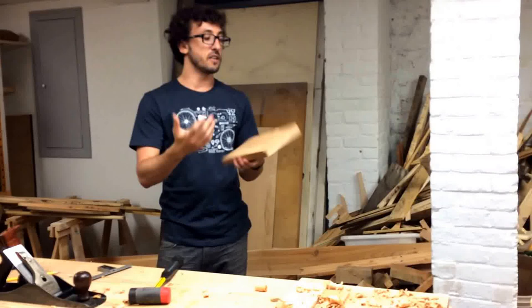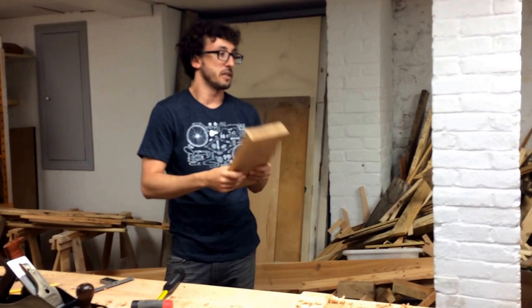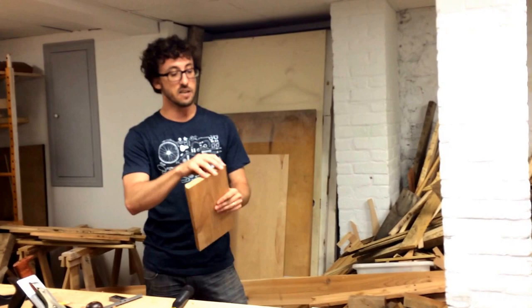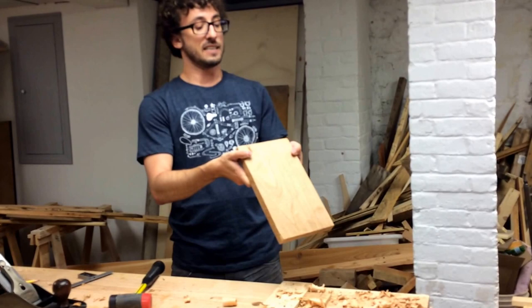And now let's say we need a certain thickness of board. When you're doing hand tools, you tend not to say, "Oh, I need a piece of wood that's 7/8 inch thick, or five sixteenths." It's just, as long as all the pieces that I'm going to use for a particular function are generally the same size. Sometimes they don't even need to be that close, because you're doing everything by hand. You're not setting up machines to make cuts. Everything's individual to that particular situation. Like when you dovetail a board, it doesn't matter if the two ends are the same size, because you're going to do everything differently the first time you go through it. But if I need a certain thickness out of this, and I want to make it easy on myself, I'm going to just find the thickness that means I have to remove the least amount of wood.